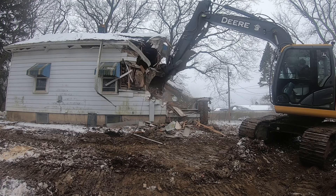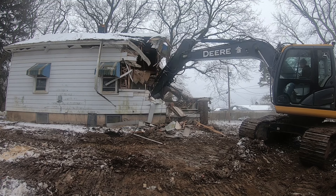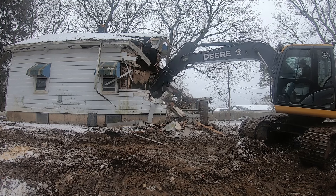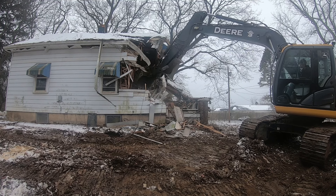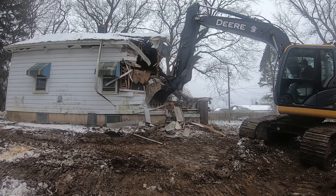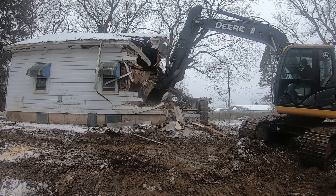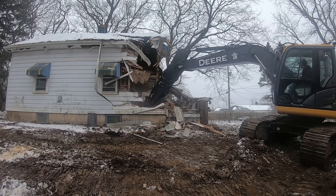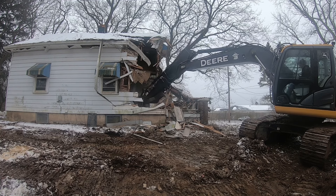It is tempting to take big old bites and just knock the whole house down in like two minutes. I broke through the floor on the first floor and I'm knocking stuff down to the basement so I've got something substantial to crush against. It's also important to keep in mind when you're pushing into a cavity like this to keep that bucket cylinder protected. We don't want to lift up into an upper part of the house and accidentally wreck that cylinder.